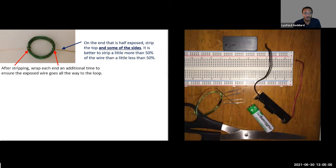The first step is building the loop, which is central to the motor — it is the motor itself. It forms an electromagnet that works with the permanent magnet to create the spinning. This part is very important: the loop needs to be tightly wound, wound in the same direction, and held together with the wire itself. It needs to be lightweight and able to spin, but also mechanically robust. The more loops you put in, the stronger the electromagnet, but there's a trade-off. We need to be very careful: on one side, strip the entire wire all the way around.